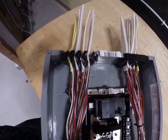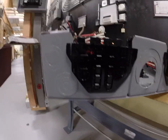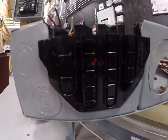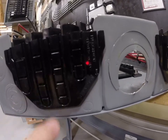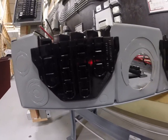They're also sized. If you take a look at the bottom of this one, you can see we've got some bigger knockouts that you would knock out with maybe your needle nose pliers — you just twist them out for some of your bigger cables. And then you can see some of your smaller cables like your 14-2s and 14-3s. So it does allow flexibility for the bigger cables as well.